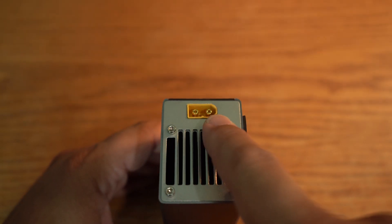So why do I shed a tear every time I use this thing? Well, the key thing is I would much rather be out there flying a battery than charging it up and wasting that electricity by putting it through this. The way this thing works is it has a port where you connect your battery. The battery then powers the logic inside. When you start discharging it, it has some heat sinks in here — it takes your battery energy, turns it into heat, goes through the heat sink, and then uses a fan to push that heat out.